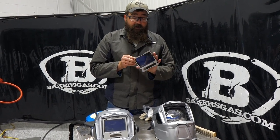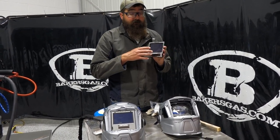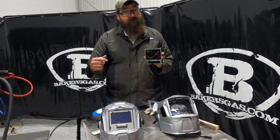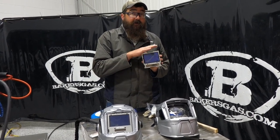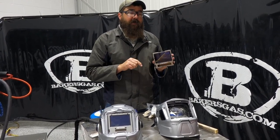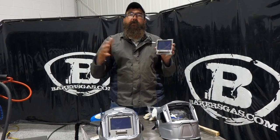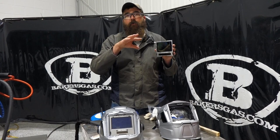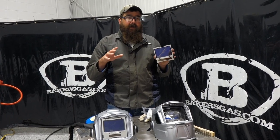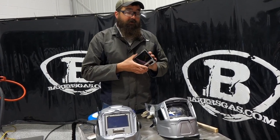It's a very nice hood — I like them, I've welded with them. They're very clear because it's got the ClearLight 2.0, so it's got the best lens they make. It also has HDV, which is high definition vision. The clarity on the T94 series is better than the Infinity and Elite because of HDV. When you're looking through your lens, sometimes things can become distorted, blurry, or skewed a little bit. What HDV does — available in every setting — is re-correct those distortions, almost like corrective lenses in glasses, so it's working with you while you're welding. Pretty awesome.